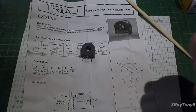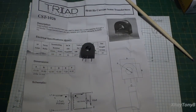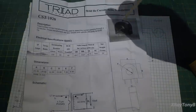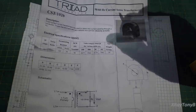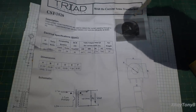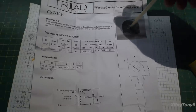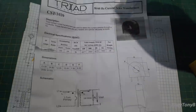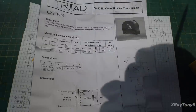That's why you use a regulated power supply. You don't want it to change — even millivolts would throw it off by sometimes amps. But it's very linear: all the way from 0 to 20 amps, you will get 0.0977 volts for each amp of current flowing through the wire. Now let's look at what I'm going to use.